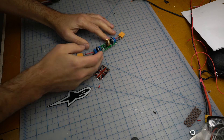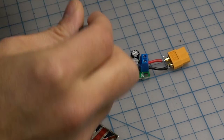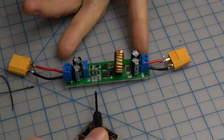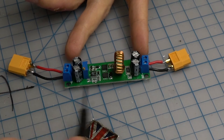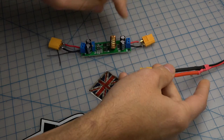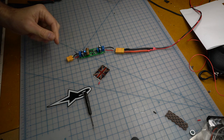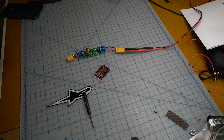First you have to configure these. This little potentiometer part has got a screw on it you can turn, and whatever voltage you've got coming in, it'll be a ratio. So we tweak this - so this is 60, we can tweak this to 30 volts. I'll plug this into my bench meter; it's a really good way of testing it. We've got the input connected and a light comes on - at least it works.